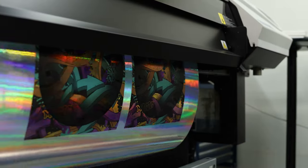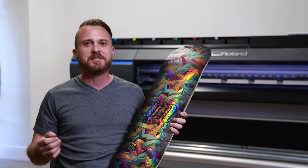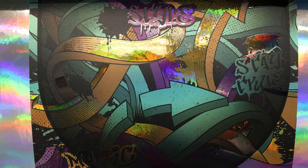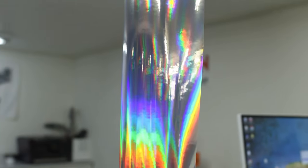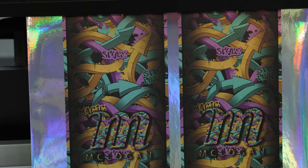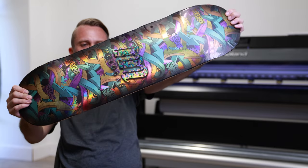And we were playing with our UV printers, and sometimes inspiration just comes from nowhere. I think I was just driving and I remember calling someone and trying to explain the idea to them. So first thing I did when I got in the office the next day is I started working on the file. This file is pretty simple, but it is about three files stacked together once we get it into VersaWorks to actually implement it. It's really just playing with some clear varnishes — the UV inks automatically knock out the silver. So as you saw, that was a silver foil with a rainbow fantasy kind of spectrum in it. But all the matted areas, we're not seeing any of that — it only comes back out once we start punching out with the gloss. It was a lot of fun experimenting with these films, experimenting with the printer, and really opening our eyes to the possibilities of UV outside of the normal applications.